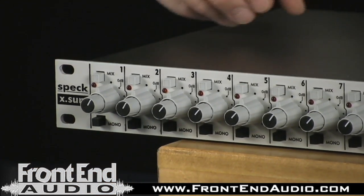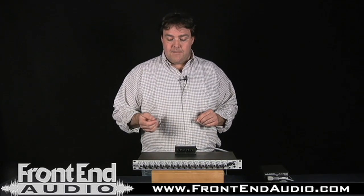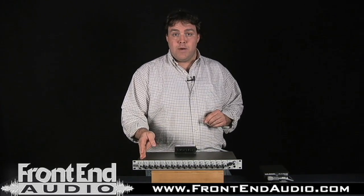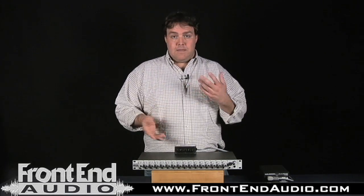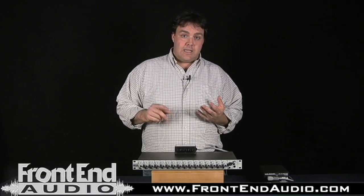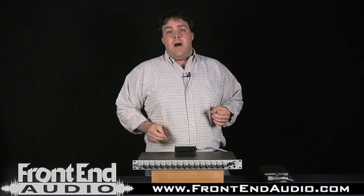And one of the things about it is it's not just a 16 channel mixer, it's actually a 32 input box. Each one of these is basically a stereo input. When you plug in a left and a right signal, it's going to be left and right hard together. But if you plug into just the left, then both inputs are gained together, so you end up with a mono panable signal across. So you can use it as a traditional mixer with the pan.